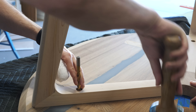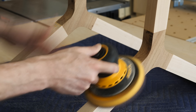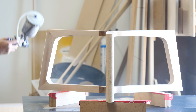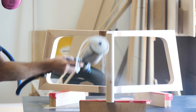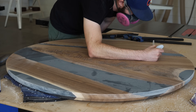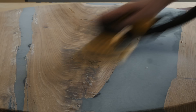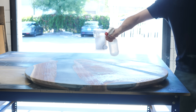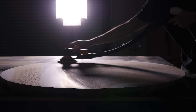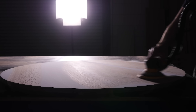With confidence high, we could mark our threaded insert locations, but I'm not going to actually install them until we've put finish on the piece. For the base, it was just a matter of easing all of the transitions, and then we sprayed on a few coats of water-based polyurethane. The reason for that is since the base is maple, this will keep it as light in color as possible. For sanding and finishing the top, it was a lot more work. Sanding and finishing used to be the most boring part of my videos visually, but with slabs, I think it's actually one of the more visually satisfying parts — it's the moment when you get to really see all of the hard work pay off.